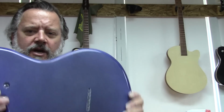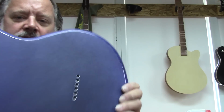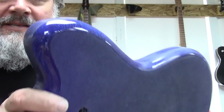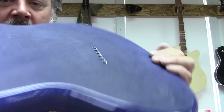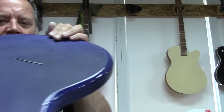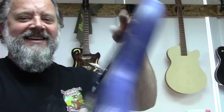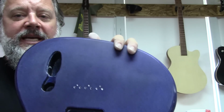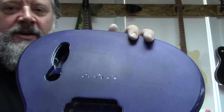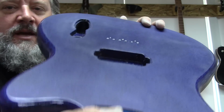All right guys, so that was wet sanding to 2000 grit. I spared you a bunch of time with watching me sand stuff because that's really boring. But as you can see, I did the back and the top completely. And it's actually starting to get shiny because that 2000 grit is so fine, it starts to add shine to it, but it's still not shiny.